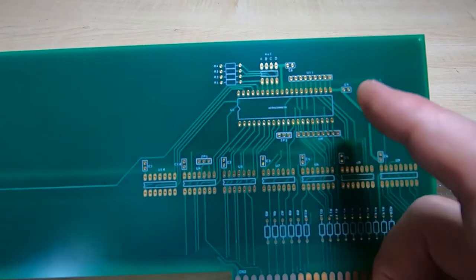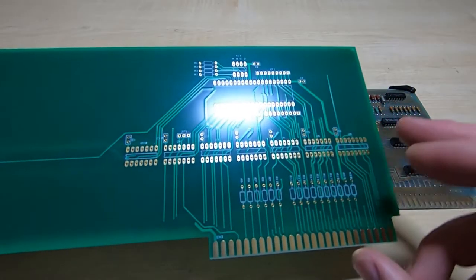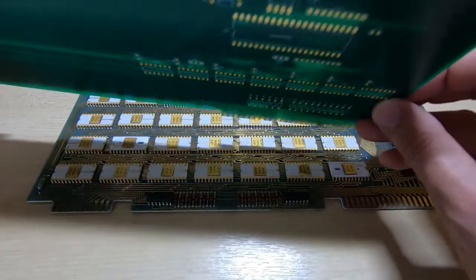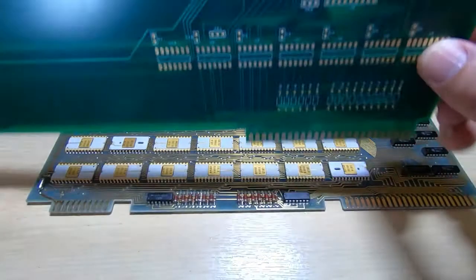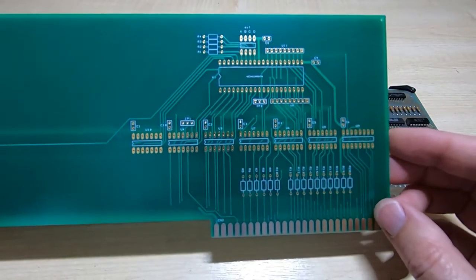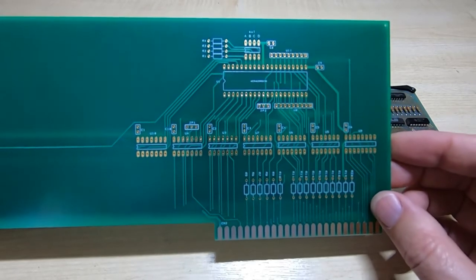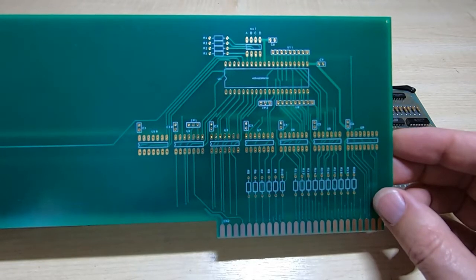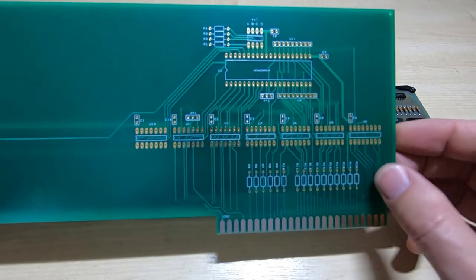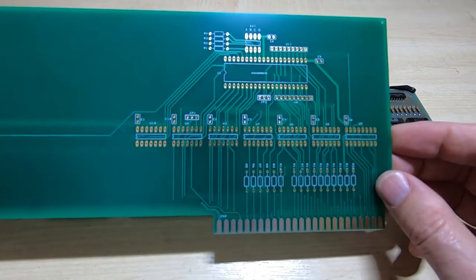When there's a zip socket in the card it obviously won't go into the machine. I have found that although the cards are very close together, if you trim off the leads protruding through the back of adjacent cards, then you can actually use sockets in the card that sits next to it. There's just about enough room for doing that, but you do need to trim off any leads that protrude through the back of the card. It's a bit of a pain, but it does mean that you can at least use sockets when you replace ICs, which is obviously very desirable.